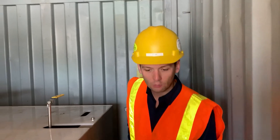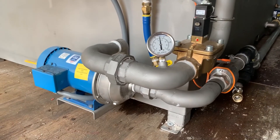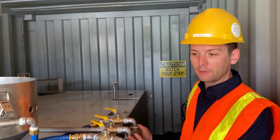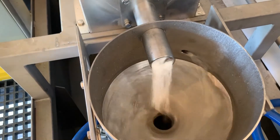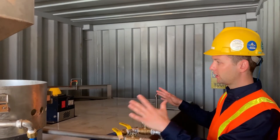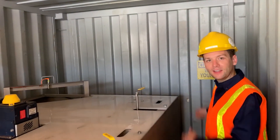When we're calling for a batch, we're going to open up our solenoid valve and turn on our booster pump, and that's going to allow clean dilution water to come into the system. The dilution water is distributed through our system through this manifold and these valves. It mixes with the polymer, and it's hydraulically sheared in this chamber. It underflows here, where the prop mixer is going to continue to stir the solution, and then it will be pumped off to process at the end.